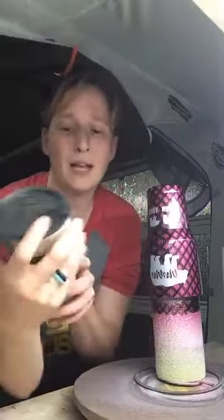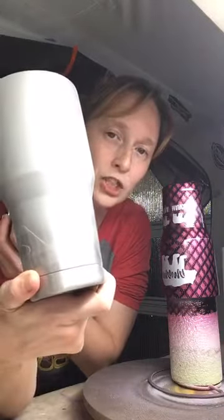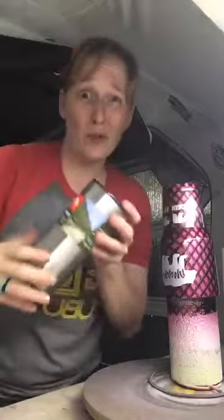Yeah, we're trying to watch a lot of videos to learn it. So the sandblaster is basically a cabinet. When you get a cup and it's nice and shiny, you have to sand it, right? For me, to sand every cup was a pain. I tried to use an orbital sander. It wasn't working for me. So we got the blast cabinet, and it'll literally blast the shine off the cup. And as Randy would explain, it gives it tooth so that it can grip the paint when it goes on. So it's a really fast sanding mechanism, if you will.